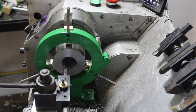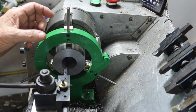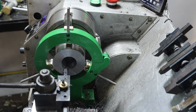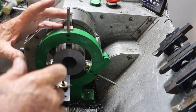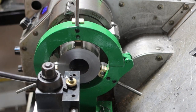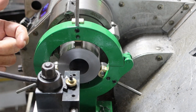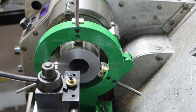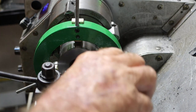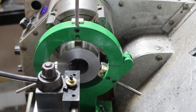There was something I wanted to do up inside — I only want about an inch, or 25mm, either end at the same diameter, and in the center I want to make it slightly larger so if I get a little bit out of alignment it won't be hard to get it running smoothly. While you weren't looking I've put that half-millimeter undercut in the center, so the middle 25mm is now a millimeter bigger in diameter than the two ends will be — just for some clearance. I've pushed the tool back so it only sticks out 30mm and changed the tip again. I'm very close and the one thing I don't want is to end up oversize.